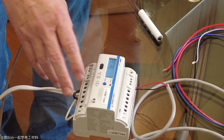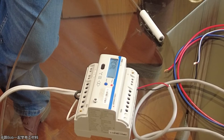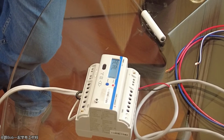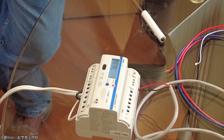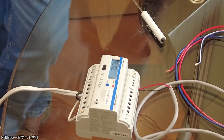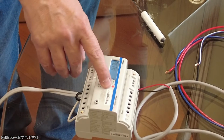There are two ways you can have the CTs: on the primary side and on the secondary side. Almost every time you're going to use this, it's going to be on the primary side. But sometimes, if you have a 600 volt to 120 volt transformer, people put the CTs on the 600 volt side. That's the only time you'd pick that. Almost always, it's always going to be on the primary side.